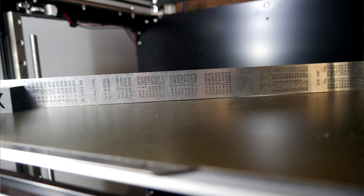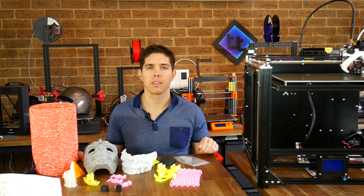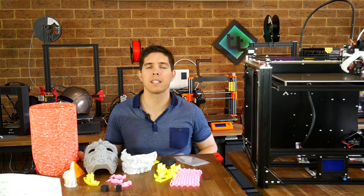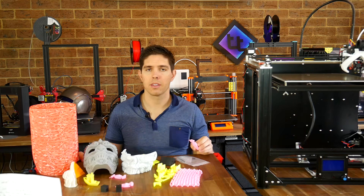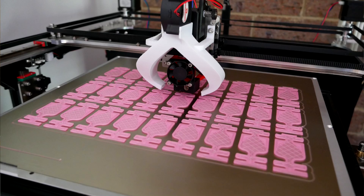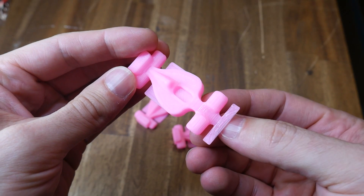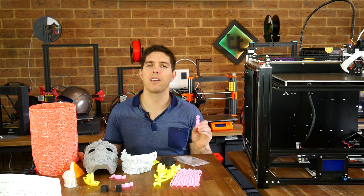Paying to have a 6mm tooling plate bed is an option not yet available for the printer at the time of review. Therefore, I've got a pretty standard bed, and it does have a slight warp. I released my updated guide on manual mesh bed levelling around this time. I could have fitted a BL-Touch or another type of auto bed levelling probe, but I decided I wanted to keep the print head as light as possible to take advantage of the CoreXY architecture. My next couple of prints benefited greatly from this, where I printed a couple of full plates of mini F1 car models. The mesh bed levelling did the job well, with only one casualty across the prints. The little details on these cars have been refined well, and the primary school kids who got them as prizes were very happy to receive them.